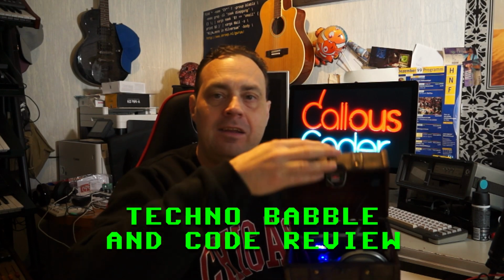Here it is. It's finally done. It was one of these feature creep videos. I started off with face detection, which was very slow on a Pi Zero. I got about 5 seconds per frame on 640. So I scaled the image down, did a histogram over it, and managed to get 500 milliseconds. But then I also wanted to reintroduce the button trigger. And since this is a Pi Zero, I turned this into an access point. I put a web page on it with 2 buttons to enable the face detect feature and to blow the horn. So yeah, that is it now. It's a bit of a beast.